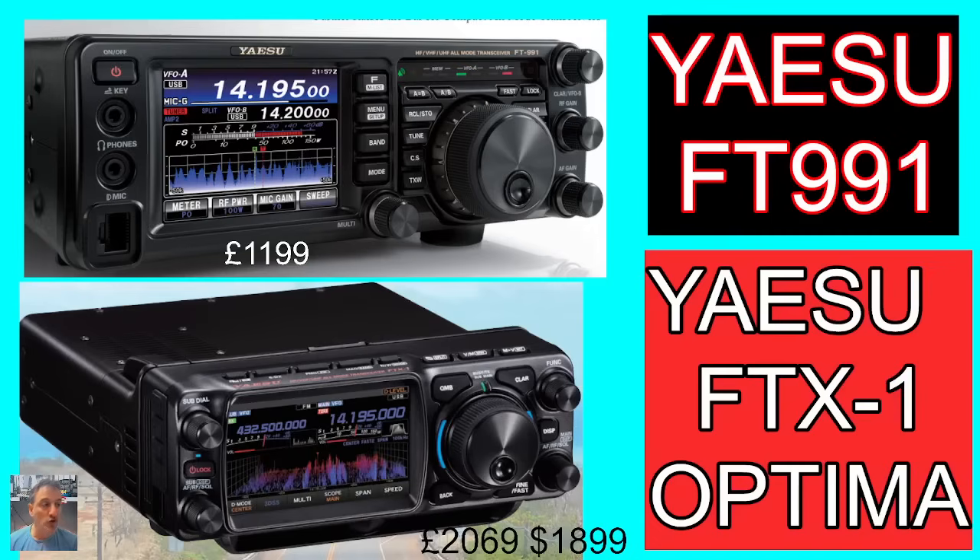Of course it's the newest model. The Yaesu FT991A has been around for a long time — it's a bigger unit and less portable. The front unit of the FTX1 is removable and you can run it without a power supply at 6 watts, and as soon as you add power it goes up to 10. It's a very portable QRP type unit. Many users just prefer that — low power QRP, 10 watts, out with their CW paddle and a length of wire, talking around the world with this tiny unit they can virtually hold in their hand.